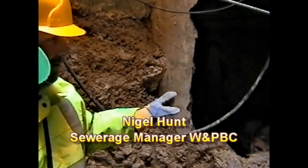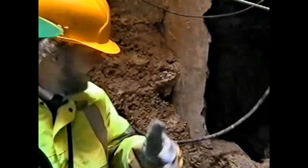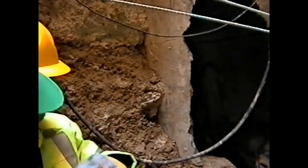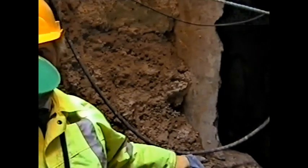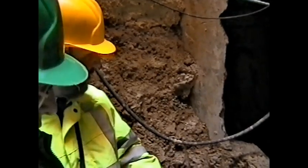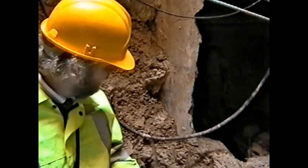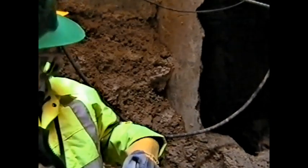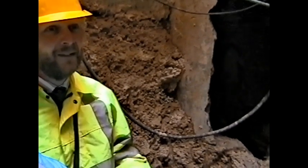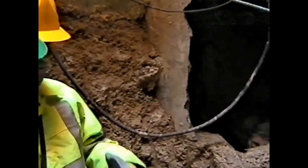The heading — we can't work out whether it was blasted out. I presume it was blasted out, but it's quite up and down as we go along. The main problem with the sewer is that if you go down to our Southport pumping station, you wouldn't see anything running from here. It exfiltrated out into the old heading, and other times it would come back in. There was quite a bad ratting problem around here as well.